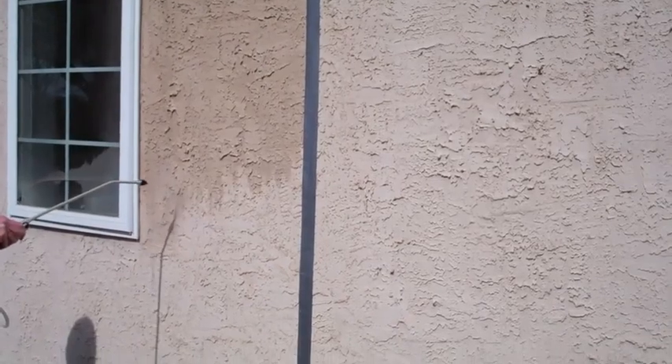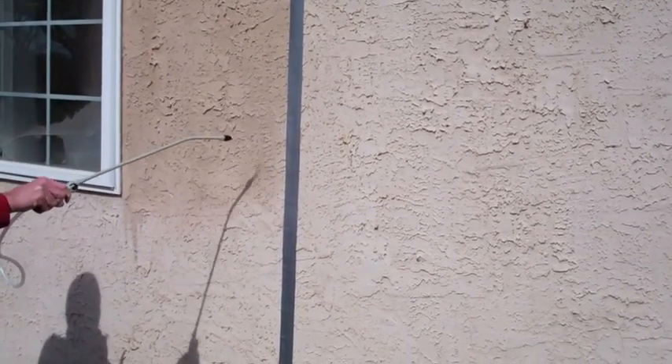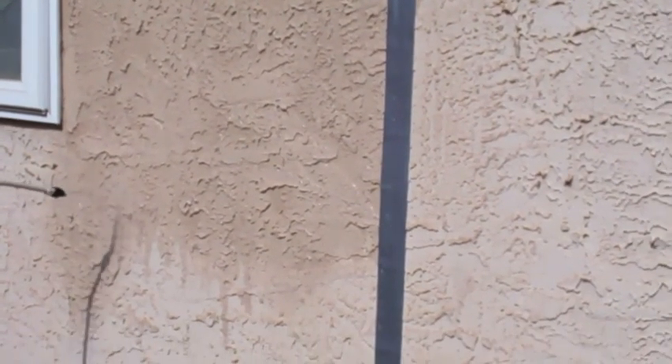I'm sort of working my way down here, trying to get the feel of it. I want to get enough of the repellent in so that we actually saturate the cladding and get a rundown. We often say a wet on wet application, which really is the second coat, is just to make sure that we do not miss any sections of the wall, which we would call holidays.